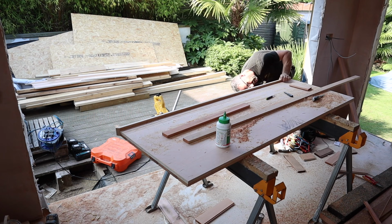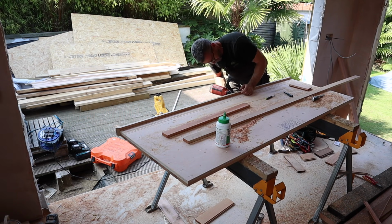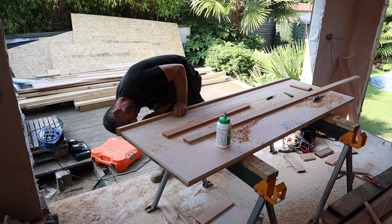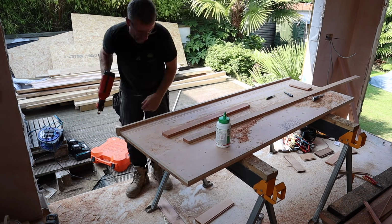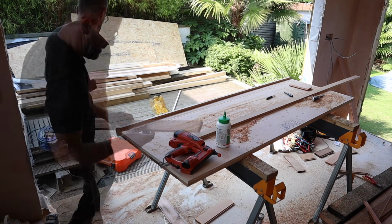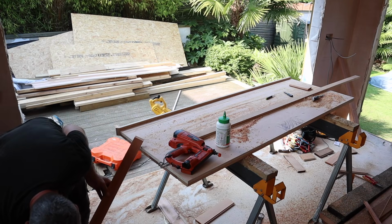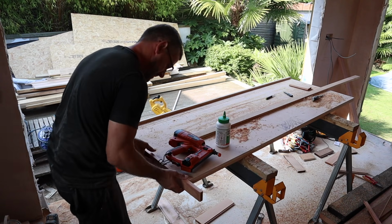So I don't fix where my hinges are going or come out the face of my door, which I don't want, obviously. Again, now, because I've got the 50mm pins, they're not going to be seen. So that's that lipping on. Now I'm going to put the head on, which is going to go there. Again, put a little sanded bevel on there. Before I fix that one, what I need to do now is obviously measure up this other one as well.